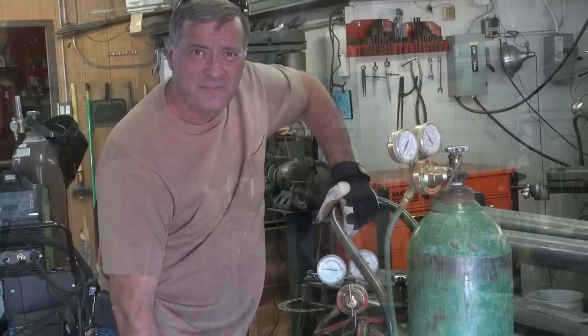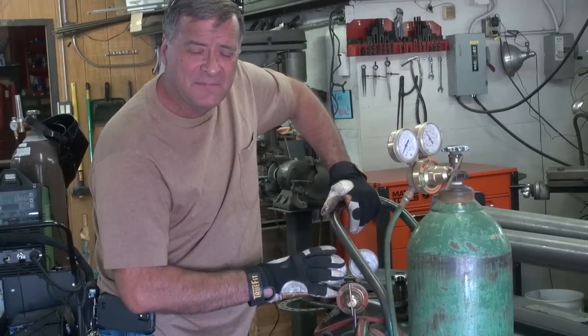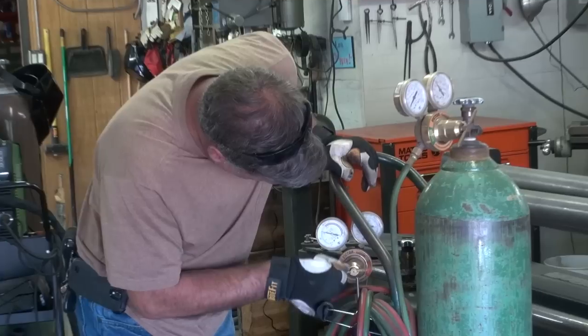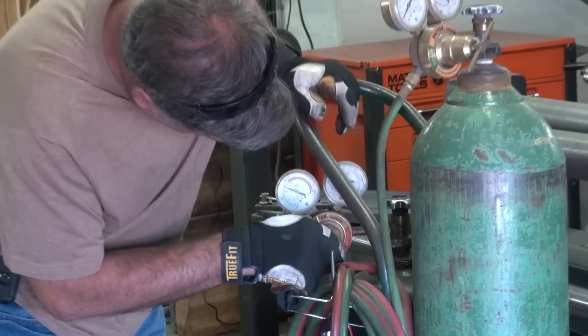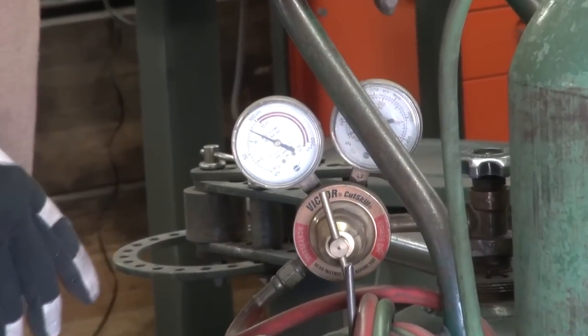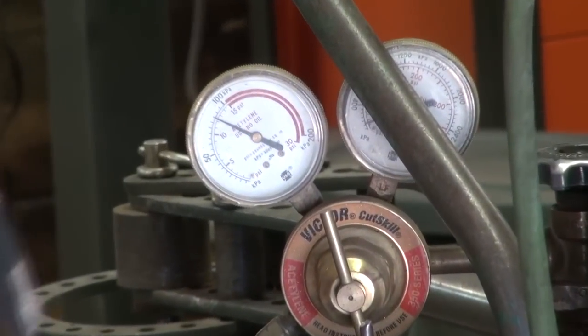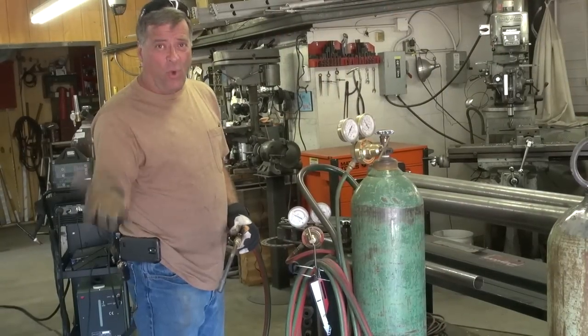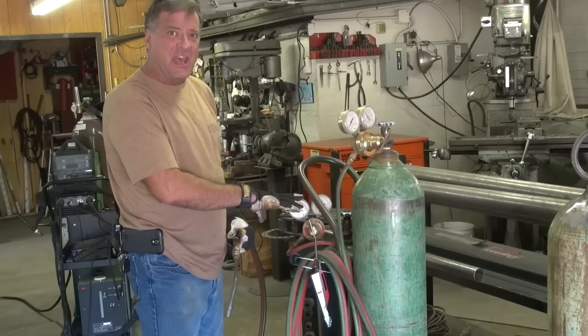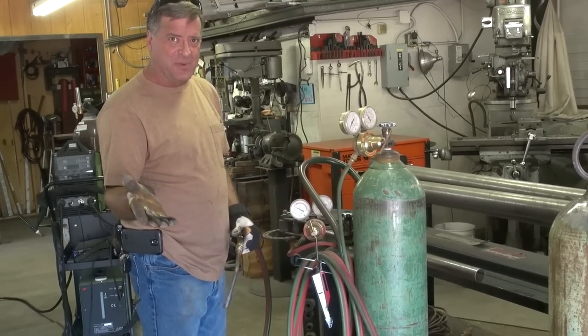If I need a little more heat, I can always turn it up. Same thing with the acetylene — the book says 10 to 15 PSI, and I run it at about 12 to 13, right in that area. I'll always adjust again later. That might be one of your problems — you've simply got the pressure set wrong, and that's causing the popping.